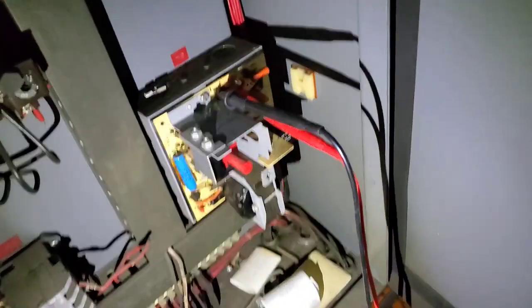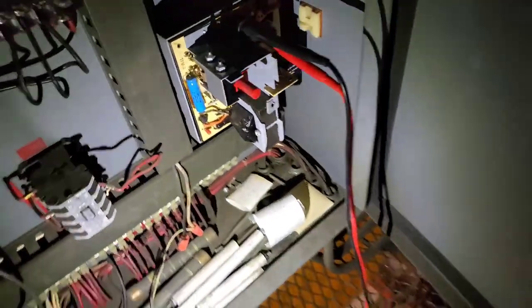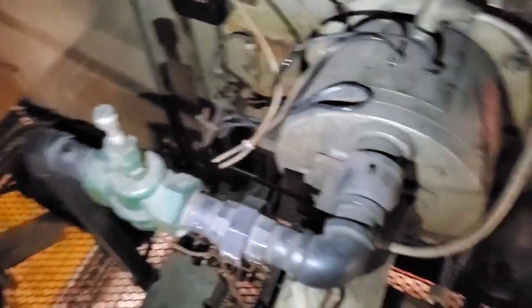The main thing here is: close the firing valve before you start working on a machine that's locked out, establish pilot, and check the pilot signal with your meter — and you're good to go. The unit is all up and running, call's over. Thanks for watching.